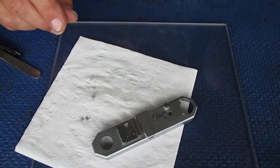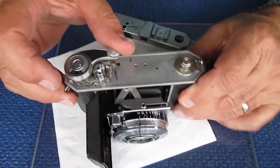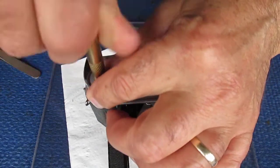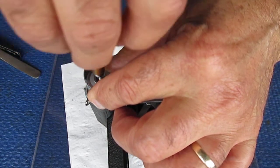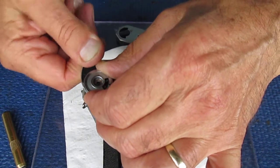What we do now is swing this round about ninety degrees. We'll remove the film advance lever — it's a little bit stiff on the shaft, so let's just see if we can get it off in one piece. Generally they're a lot sloppier than that. It's okay — there's no harm in it being nice and snug, because it's better that than the other.